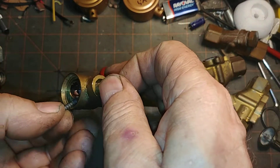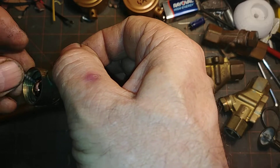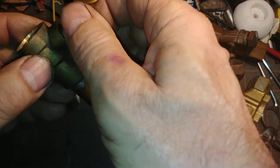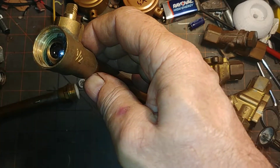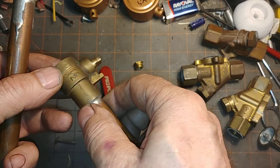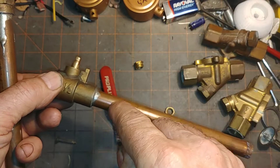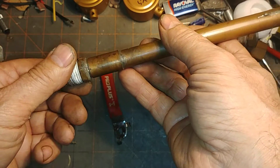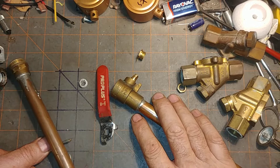The ball and the stem come apart. If you have suspicions, go ahead and replace this with one that's more resistant to overheating. I usually like the red-white valve if you can get them, or you can get a male adapter, sweat that on, and then crank on a male iron pipe fitting — that's probably your better deal to make certain this valve is not going to pass water, because it gets really frustrating to track that one down.